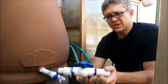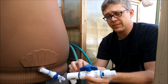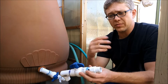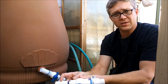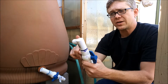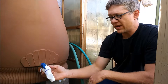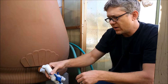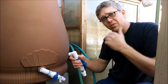Basically, I'm just duplicating what was on there already. Besides these three fittings, you'll also need some three-quarter inch PVC, a way to cut it, primer, and glue. Cut the lengths of PVC, prime everything, and glue it together. I chose to use a 90-degree bend at this end in order to keep the pipe from sticking out too far from the rain barrel. This way I can keep it in tight and angle it so it's straight down or at an angle toward where I'll primarily be using it.